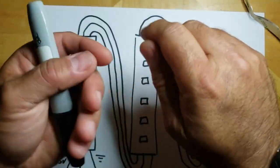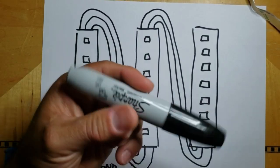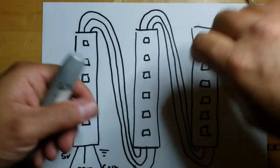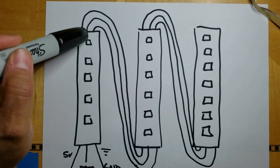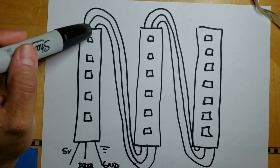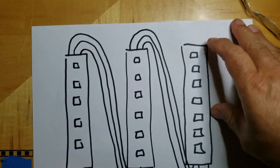If you don't want to cut the wire open, if you take a Cat5 wire and you kind of bend it at a 90-degree angle, if it stays at that 90-degree angle, it's probably solid conductor. The stranded stuff is way more pliable, and it doesn't have that same kind of memory effect, and that's why I like using it with this project, because when I solder these 3 connections here and kind of drape the wire down to the necks, I don't have to worry about yanking on these little tabs too much. All right, so that pretty much covers that. Let's go on and talk about something else.